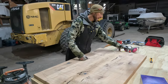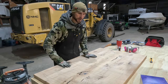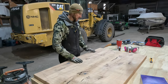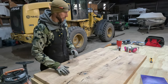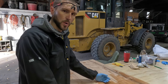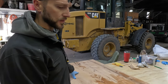Marking up your slab really helps because epoxy sands a lot harder than wood. If you're not careful you'll really have a tendency to burn your wood down while the epoxy stays high, so use good sanding etiquette — be careful, especially if you are a novice like myself. I got the top sanded down to 150 grit, using the pencil to ensure an even sand. I just wiped it down with 91% isopropyl alcohol. This is the bottom side — I will finish this first.